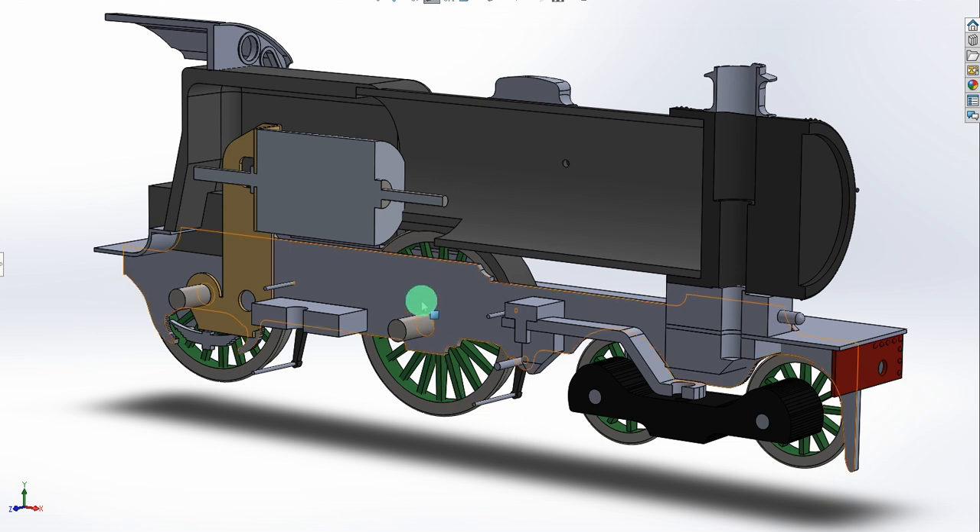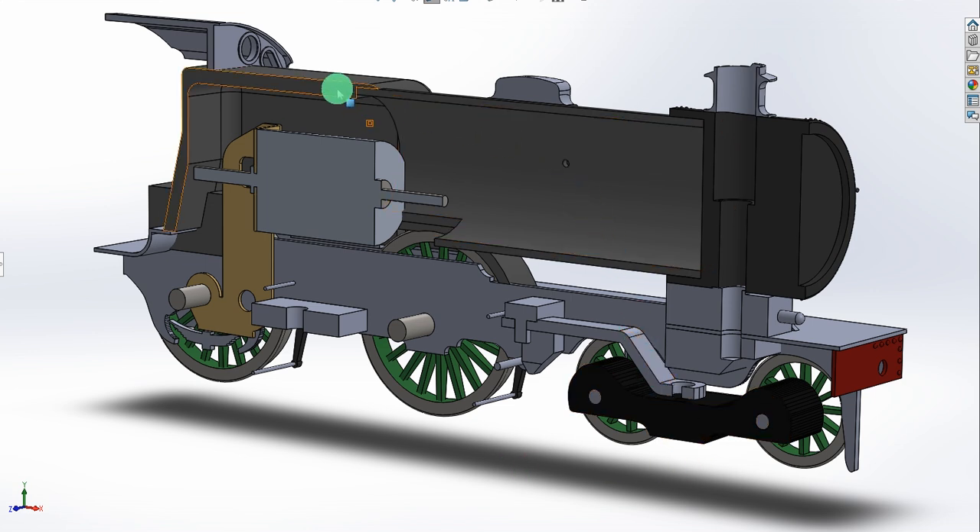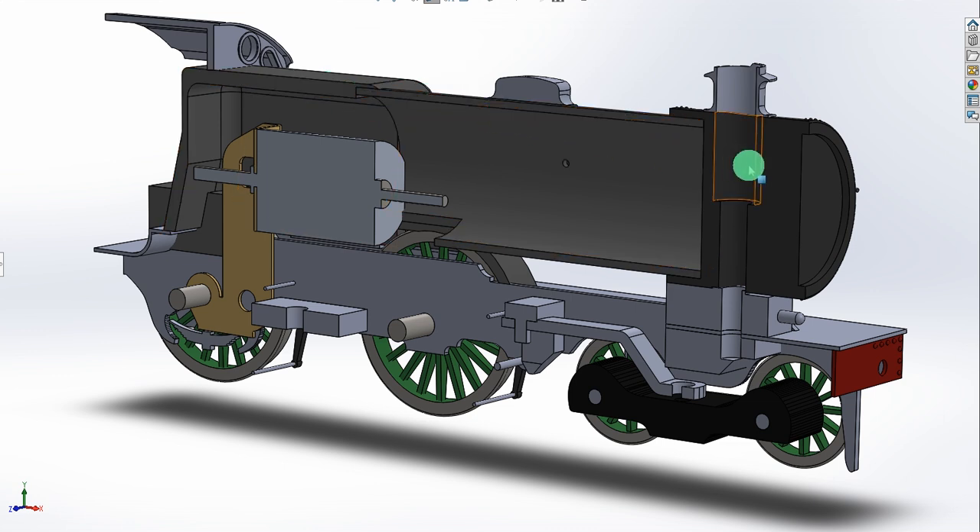The frames, running boards, and stretchers will all be brass — I may even use nickel silver, which is probably slightly easier to solder. The idea is that the firebox and smoke box will be 3D printed, and I'm currently thinking I'll make the boiler barrel out of a piece of brass tube, simply because it'll be nice and easy to solder boiler bands onto it. However, I may well make the whole thing one single 3D printed piece — I did a test print for the E-Class and a one-piece 3D print was just simple, so I may go down that route.